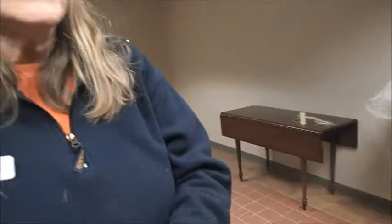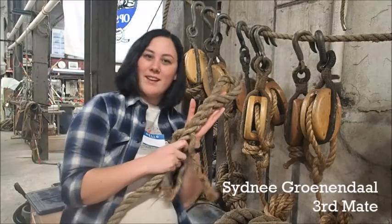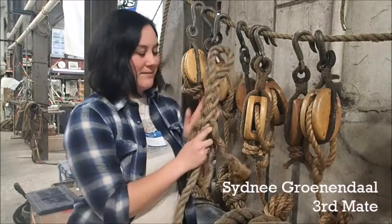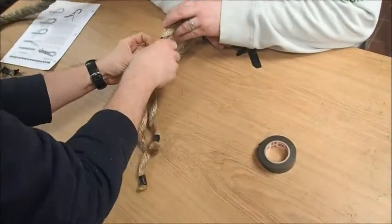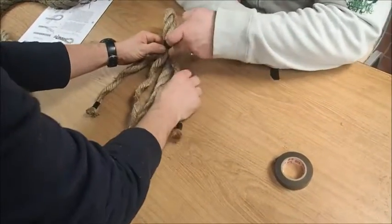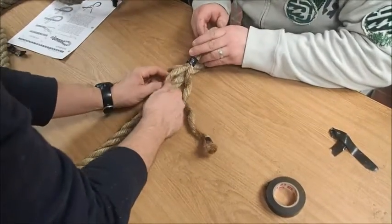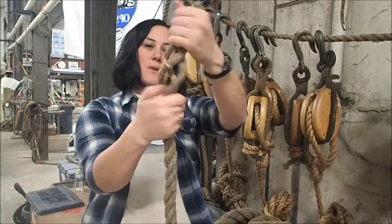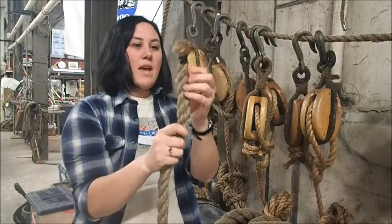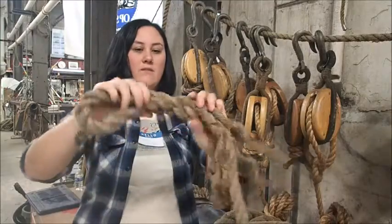It's finally clicking in my brain. I can't ever get this started correctly. I can help you. Today we are sail training about eye splices. You can see here, this is an eye splice done on a piece of manila. I'm picking the one that's in the middle — is it better for the middle ones on the top or the bottom? On the top. This is a three-strand rope; you can see it's got three separate components that are twisted together, and each of those will unlay and then retuck so that it gives you this pattern.